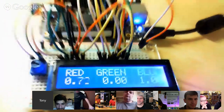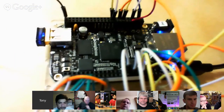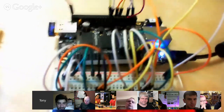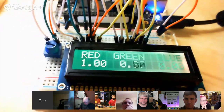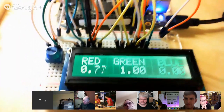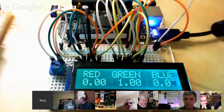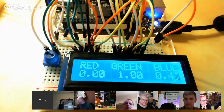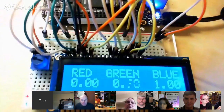You can drive this, and the really nice thing with the BeagleBone, of course, is that you've got 65 plus or so GPIOs. So you could attach quite a few of these LCDs. It only takes about 8 pins or so for the LCD and then a few for the backlight. So you could really go wild and use a lot of these without having to use an extender. So it's a pretty neat, easy way to add an LCD. They're not too expensive, and it works pretty well. They're pretty easy to read.